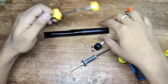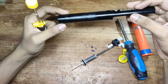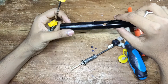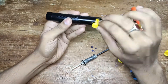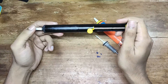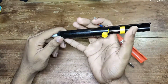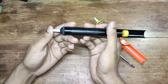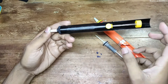The build quality is very very awesome for this metal one. It is actually made of aluminium alloy, and it does not catch any soldering material. The setting process is very simple — you just push it and close the head. If you do not know how to test a desoldering pump, you need to push this piston lever and then press your finger on the front section or on the pipe.